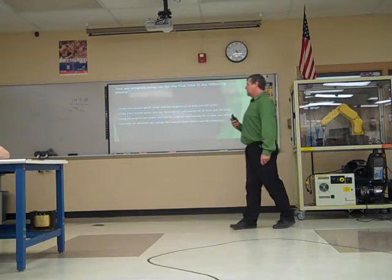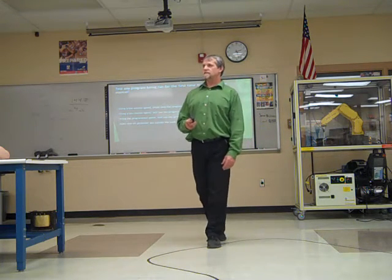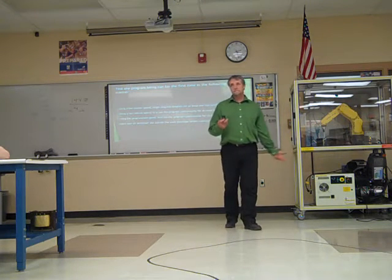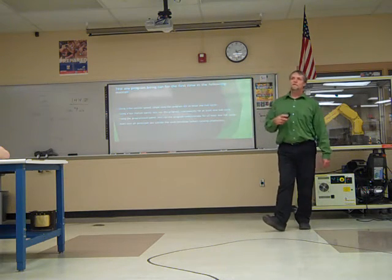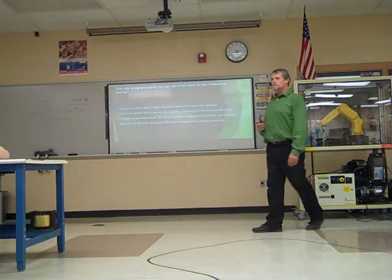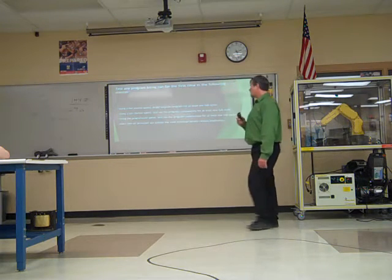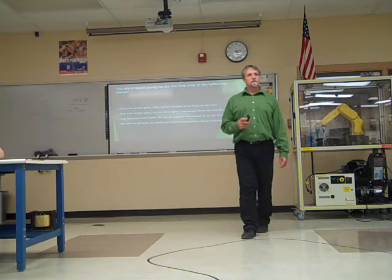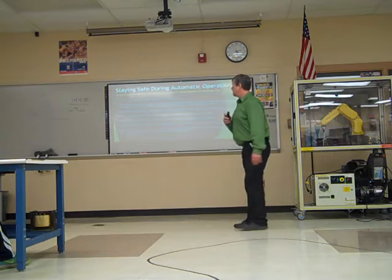Run your test program continuously once you've gone through it step by step. Then run it continuously at a slow speed before you run at full speed. Kind of makes sense. Step it through one at a time, run it continuously slow, and then you can speed things up and make sure that it's doing what it's supposed to do at production speed. Of course, you're going to want to make sure personnel are outside of that work envelope. Nobody should be inside the cage.